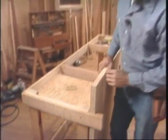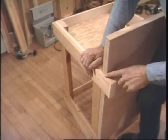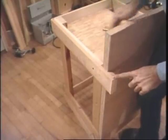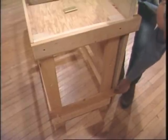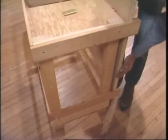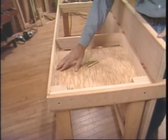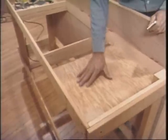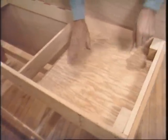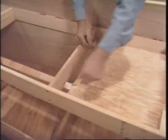This is a door bench made out of framing lumber and it's really easy to make. It has a stop here across the top that'll hold the door in place and you can adjust it for the door thickness. These rails across the bottom are adjustable so you can use different sized doors. There's a compartment on each end that's lower than the top so your tools will be out of the way. There's a plywood bottom which makes the frame more rigid and it's open on the end so you can sweep out all the sawdust and debris.